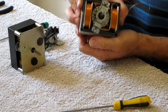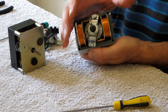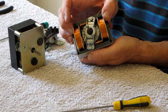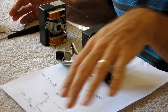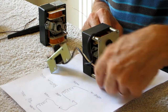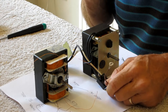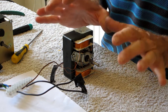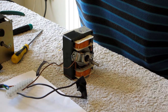That's fixed the pole pieces temporarily while I test. I've got all the wires coming out this side — now I just need to fit the rotor and figure out which way around the wiring will go. That's the rotor fixed now and it's starting to look much more like a motor — it's spinning, which is great. I'm going to move on to complete the wiring. There is only one way these can be wired, so I've used this fully wired example to show me how the wires go between the coils. I've got a sketch of that so I can wire this one up the same way. I've also made a grounding lead. The power is connected, hands are clear, the frame is grounded, the wires are completely dressed away from the frame — and ready to hit the power. And yes, it turns!